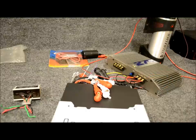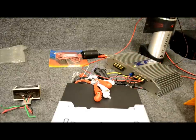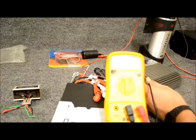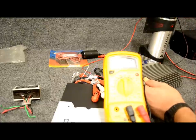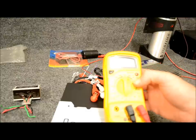Like I was saying, I have my source unit. The ground is connected in parallel to this amplifier and also in parallel to this capacitor, and it's also going over to my power supply. So they're all together. If I take my meter, set it on resistance — the same setting, 200, which is the lowest setting — one probe to ground here, one to here. I got 5.5 ohms. Believe it or not, that's actually not that good. Typically 3 ohms or less is acceptable. But this is not a working vehicle, so I don't have to concern myself with this problem.